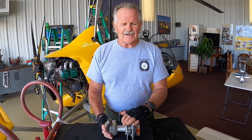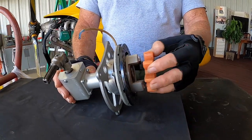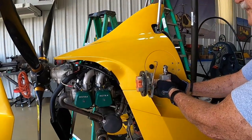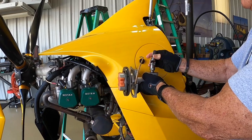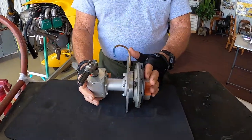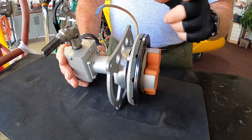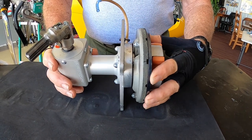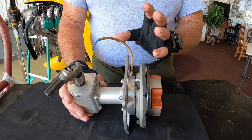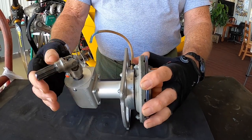This is the most complex part of the pre-rotation system. This is a right angle gearbox, and it's a reduction gearbox. And then you have a rubber coupling. This clutch is located on this end of the engine, and it has a universal joint with a spline that goes up to the rotor head. The operation of this is just like a standard shift clutch in an automobile — you have the part that continues to rotate with the engine, and a non-metallic part that's the clutch. There's a small air cylinder here; this is the line to the air cylinder. The air cylinder creates pressure and pushes the rotor together with the clutch material, and that starts your engagement of the gearbox.